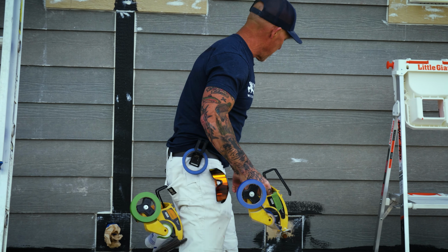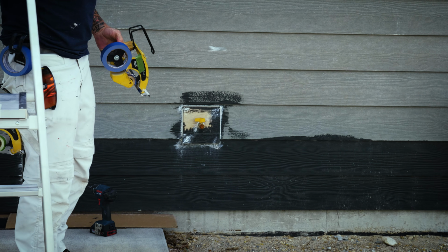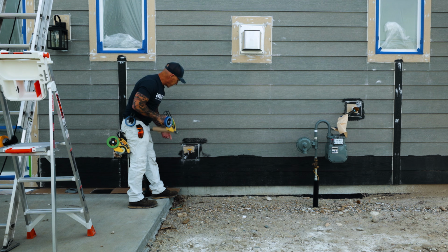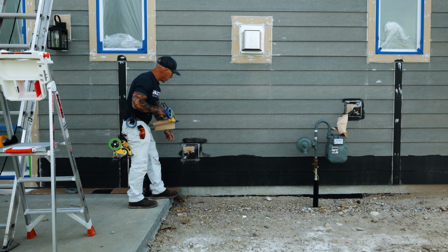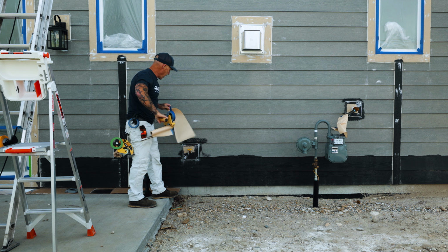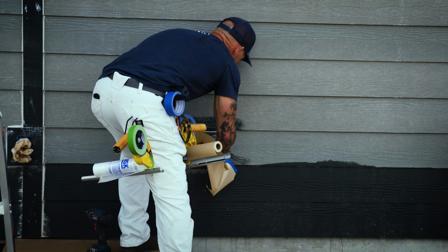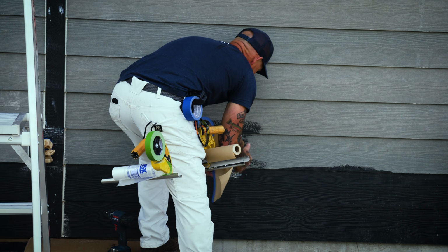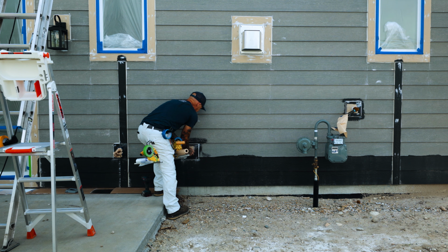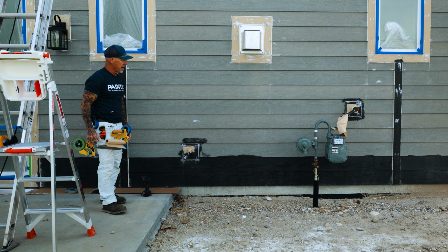This is a pipe right here that is a gas pipe for something maybe like a gas barbecue. So you have the option. It's starting to rust on the end. We can paint the thing. We don't want to paint this handle. It identifies what it is. You have the option of masking off just the handle, or I can mask off the whole pipe itself. I'll wrap some paper around that, tuck that in, and that's how that is masked off right there.